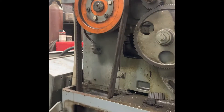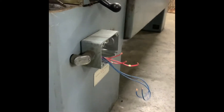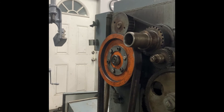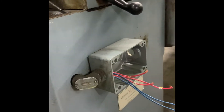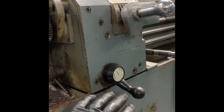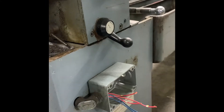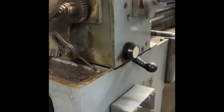The VFD is going to control our motor. We're going to eliminate the brake and use dynamic braking through the VFD. I may keep the front box and install a coolant switch — after we eliminate all the stuff inside the original breakout box, we'll put a little contactor in there with some control voltage. I was also thinking about a jog feature where you push it and it just jogs the VFD for a moment. It would be nice right by your threading, so if you can't get it in gear without kicking the spindle on, you can just push that jog button to oscillate the spindle and put it in gear.